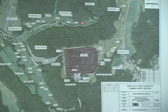And you have these valleys down here where we're going to obtain the borrow. We're going to obtain both topsoil and most of the fill to provide the profile at the site. So these are the areas where we're going to get the material.